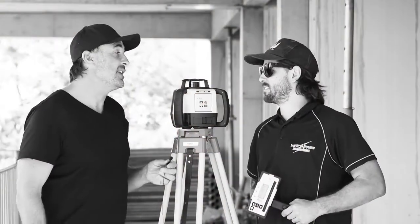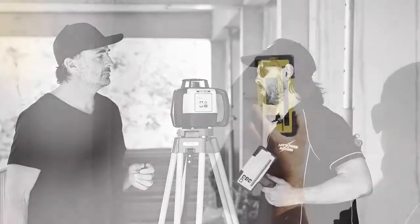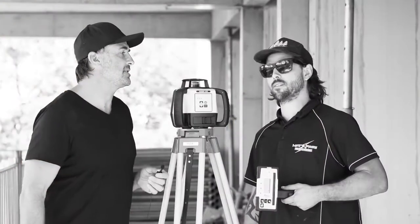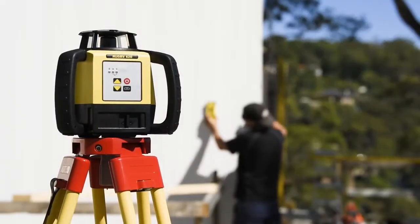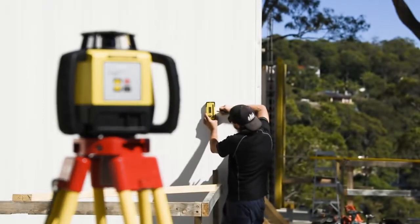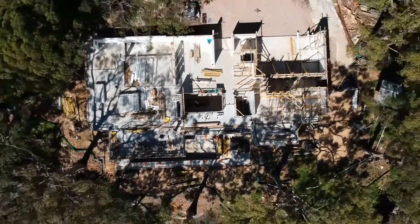The Rugby 620 is a self-leveling horizontal level with a dual-axis manual slope. What can you tell us about the accuracy? Good accuracy — we've got plus or minus 1.5 mil at 30 metres, which is great for general use. We put it through its paces upstairs and even outside in direct sunlight, shooting across pretty much the entire length of the site, and it was bang on the whole time. In terms of rotations, it's pulling out about 10 rotations per second, and she weighs about 2.6 kilos. All in all, some pretty good specs.